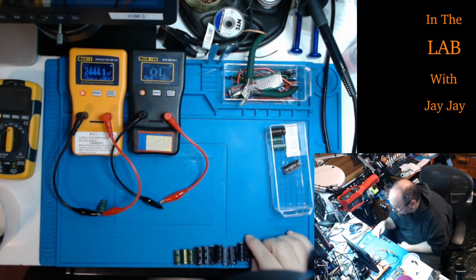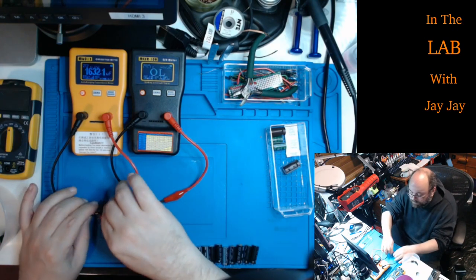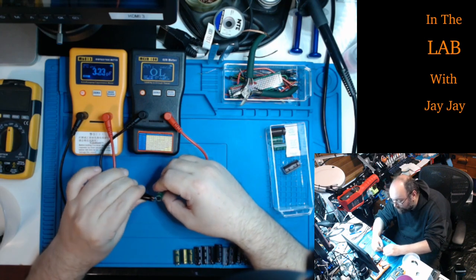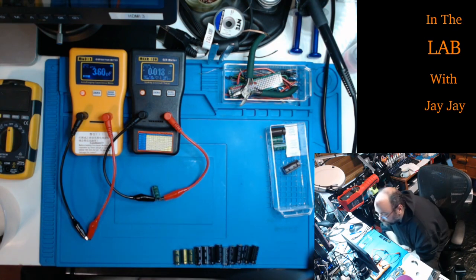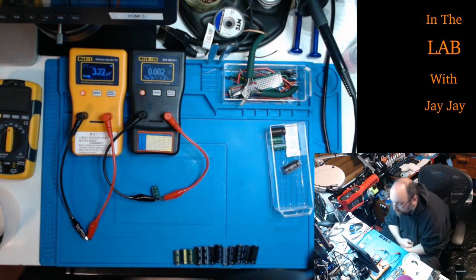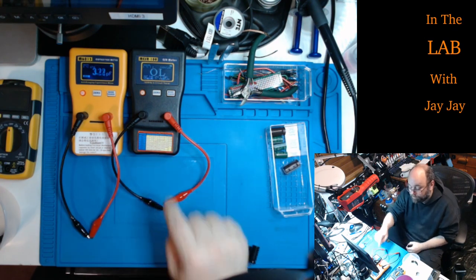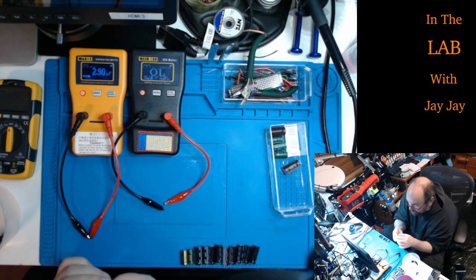There really is just no point in fixing things that aren't broken, is there? Although maybe they're old and they're on their way out and you should just recap the whole board. I don't know. What do you reckon? Okay, that's 0.0. Yeah, it goes all the way down and then it starts to warm up and comes back up. But it's well and truly within spec, I mean, easily. According to this table here, anyway. Yeah, these capacitors seem to be in pretty good health.